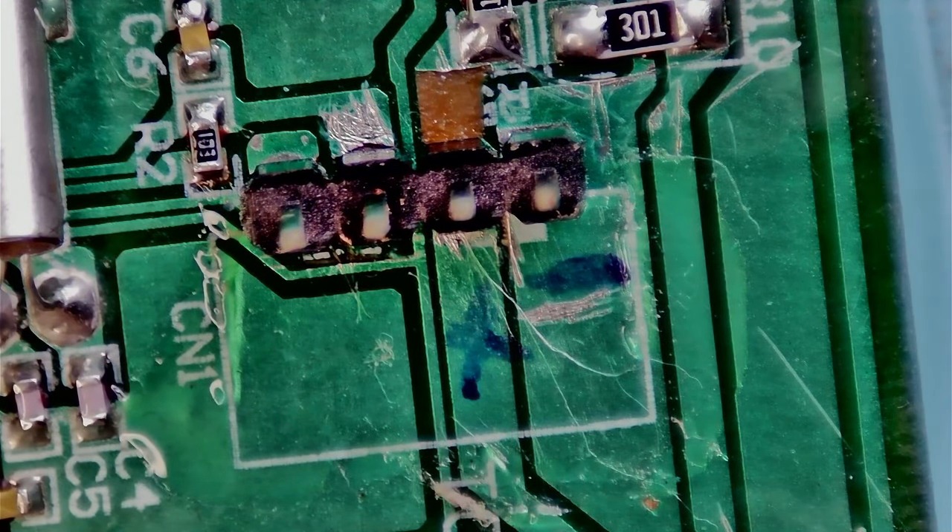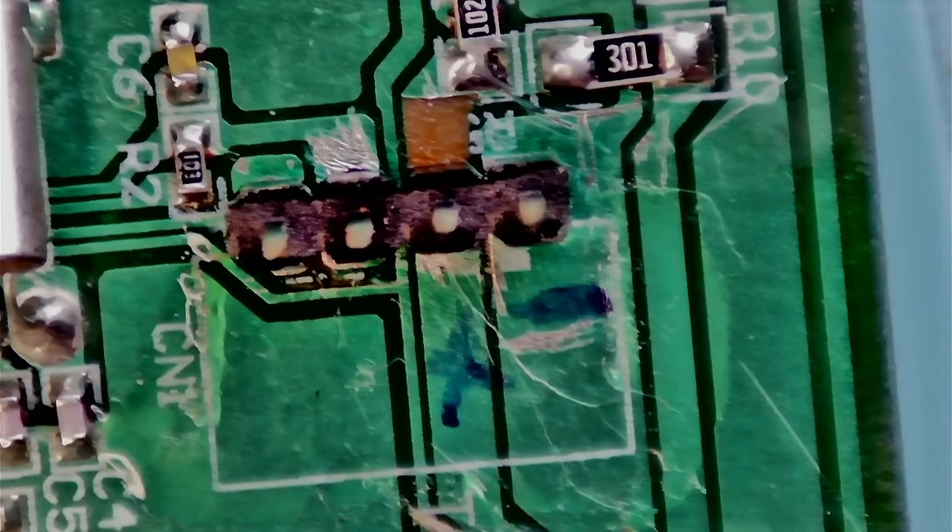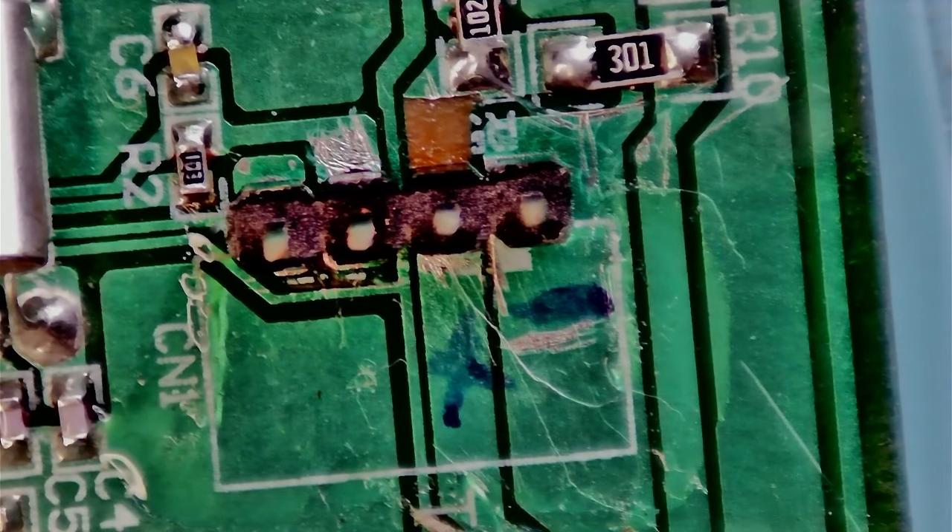The trick to cutting these efficiently is to hold one side with tweezers and then just bend on the snapping line. Testing the fit - the pitch is exactly the same as the one that was there. I'm guessing it was lying down because if it sticks out like this the wire will get caught in the fan that's exactly behind - the actual LCD has a fan right there, so it has to be bent 90 degrees.